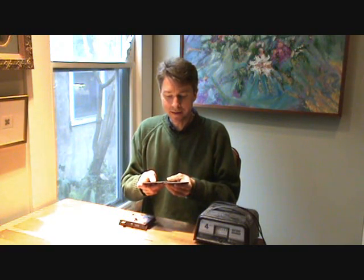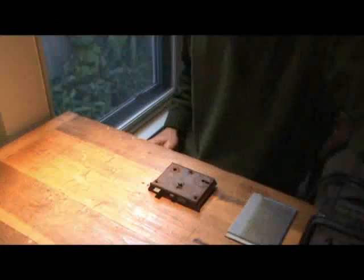You'll need a sacrificial metal. I've got these stainless steel plates — they're great. You can use any kind of ferrous metal, but stainless steel is going to last longest. If you don't have stainless, you can use sheet metal, anything. The key is large surface area. You can even use pan lids from a flea market. Just keep in mind that you need surface area and stainless steel is best.